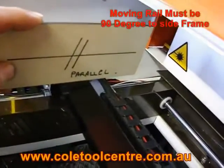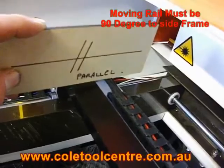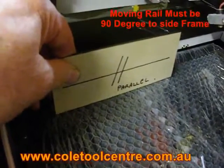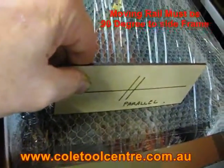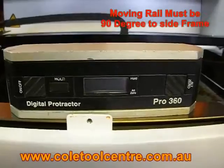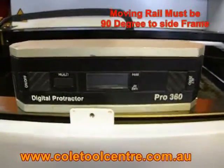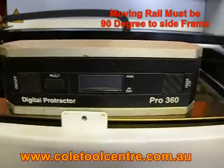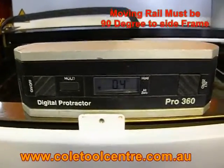Across there for your laser head rail, also the left hand side of the honeycomb tray must be parallel to the right hand side of the honeycomb tray. This is a digital protractor — this is the ideal tool to use when you are setting up your laser. The reason being, if your surface that you're on is not level...